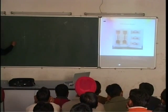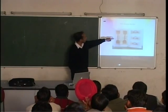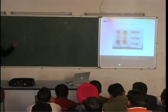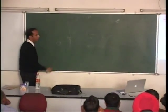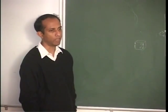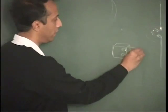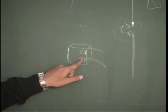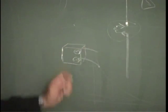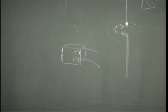What do I mean by that? I mean that there's a chip. A tiny little chip. It's barely visible, there inside that gap. On this chip, there are two pads, and that's the input and output. These are to be connected to a 900 megahertz antenna. There's a technique called wire bonding by which you connect these pads to an antenna. These are very small, you cannot see them with the naked eye, you use a microscope. So there's a machine to wire these pads to some structure outside. So that's what this antenna is.